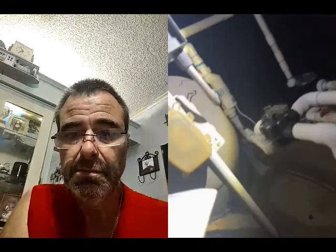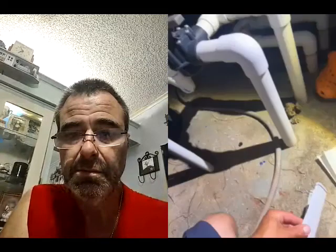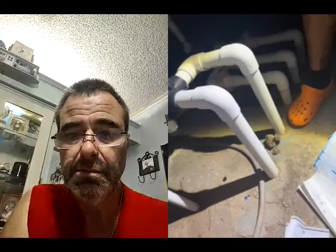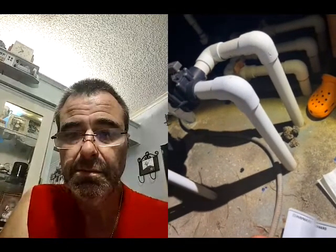All right. What I would do is see your sub panel right there. See on the end on the right side, you got those two things that can come out there. You have room for another breaker there. Yeah, I see. So see what your rating is on that Hayward box. If it's 30 amp, it might be 30 amp at 220, I'm not sure. But you could pop that out and put a 30 amp in there, and come right off of that into your Hayward box, and then you're good to go. And if anything happens with that, the breaker will trip. You know what I'm saying?